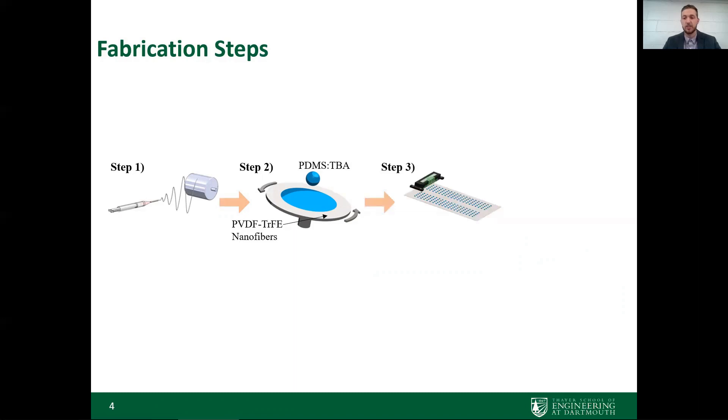The inkjet printing step uses a 0.8 weight percent PEDOT:PSS ink with a Fujifilm Dimatix printer. The patterning can be easily adjusted and iterated quickly, allowing us to create complex electrode designs. Finally, the substrate can be flipped over and printed again to create the standard sandwich structure that many piezoelectric devices have, finishing with full encapsulation in PDMS — resulting in really flexible, fully polymer inkjet printed devices.